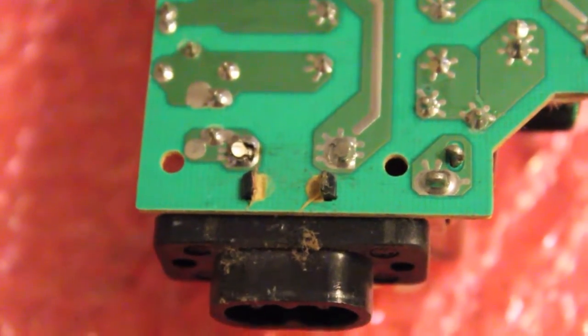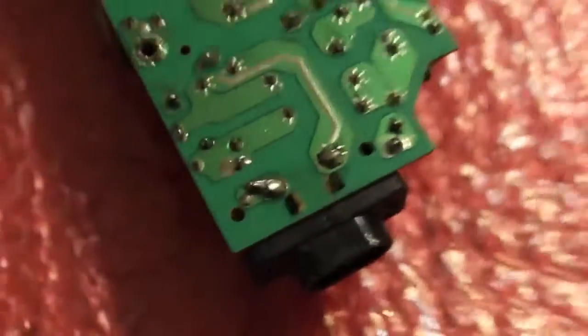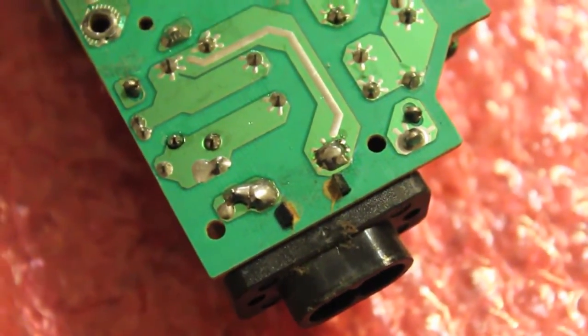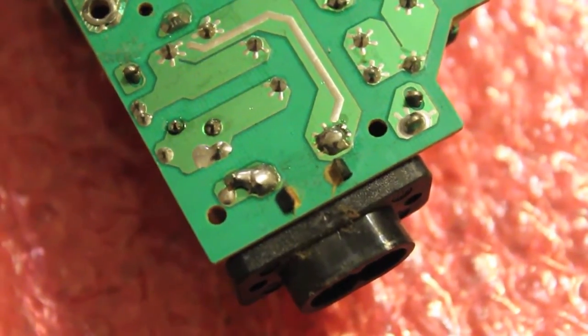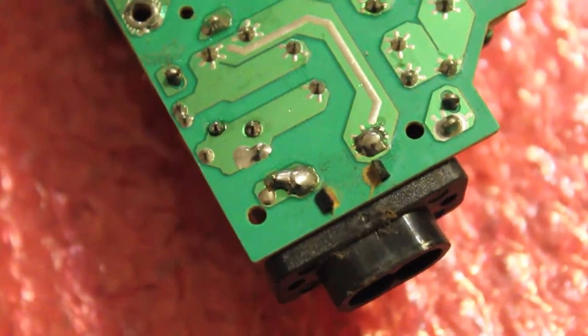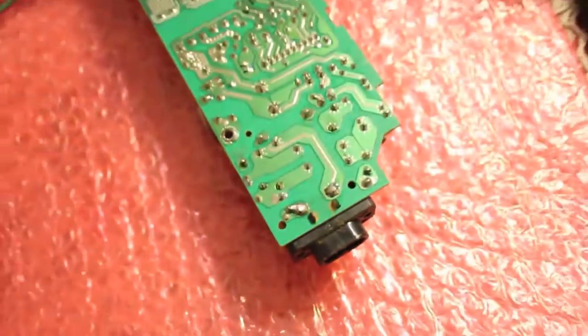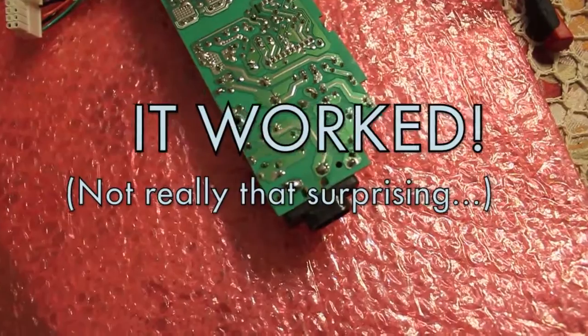Consider this intermission. And we're done — that has been reflowed, fresh solder added, and they're nice and solid now. So we'll go have a look and see if it still makes the same noise. If it does, that's a bit concerning. If it doesn't, we've solved the problem. And we'll be back with some TSOP flashing.